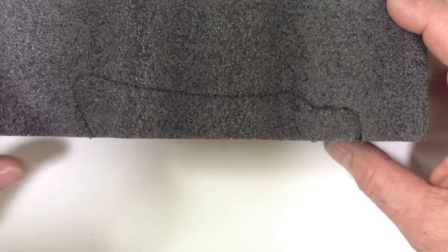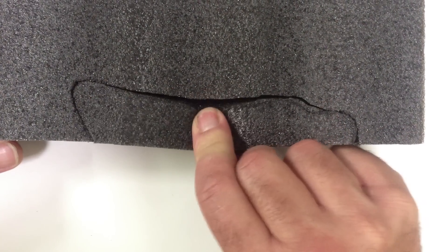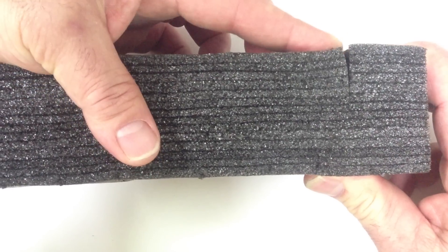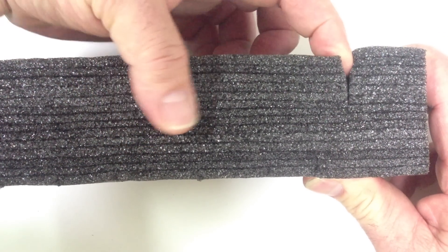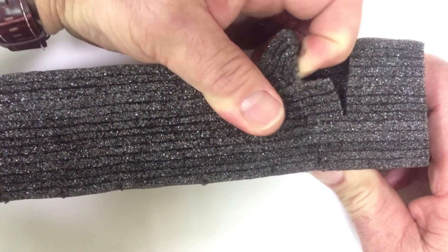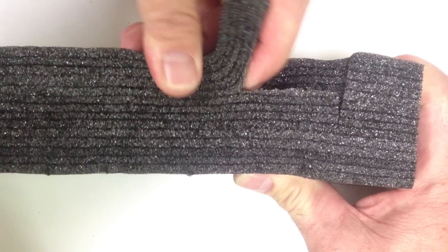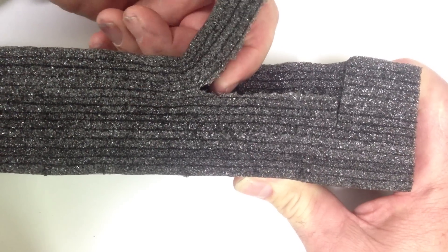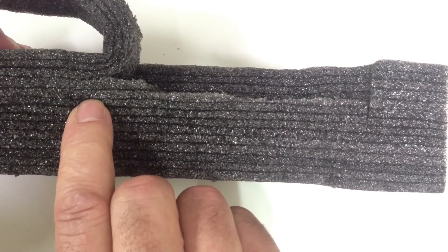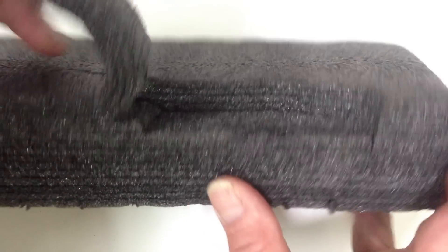To further explain the plowing concept, I did a quick cross-section. I've already made all the cuts here, so this is what's actually happening when we turn it on its side. You can see I've made the cut much deeper than needed. You put your finger down in there, establish the depth you want, and begin the separation at that layer — your finger is actually maintaining the separation at that layer. The problem most people have is they think you just simply start ripping it out, but as you can see, that doesn't work — you start ripping across multiple layers. The key is the plowing effect to get a consistent bottom.